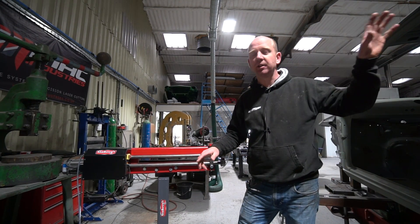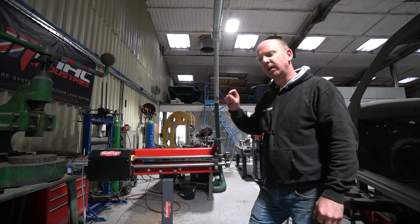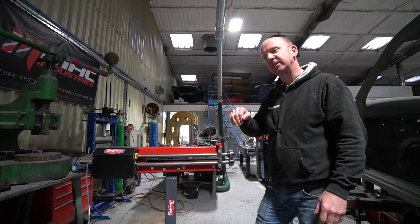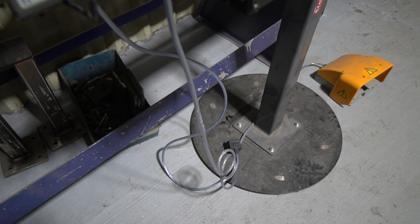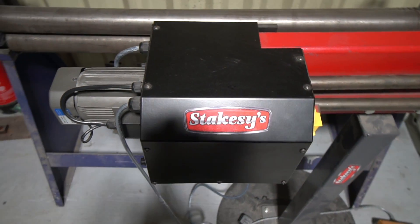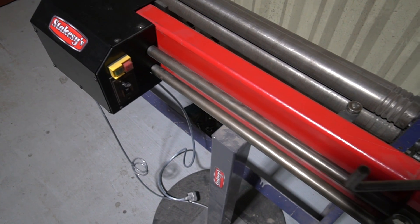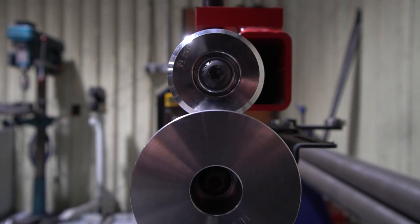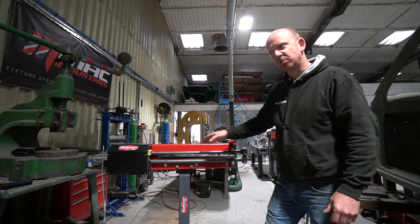The main pros with the Henry Pell's machine is that it will cope with very thick material — you can put a bead into two millimetre thick steel very easily with no problems at all, whereas clearly these rollers will not do that. However, because it's a reciprocating machine it vibrates, and trying to manually feed an accurate line without an edge guide is extremely difficult. On these rollers you can freehand very easily, so we tend to do freehand work following a marked line, or edge guide work that is difficult in the reciprocating machine — largely turning edges on curved sections.